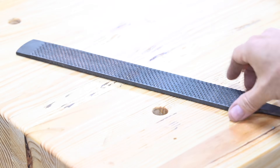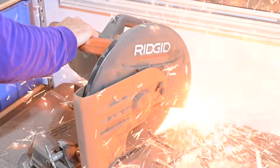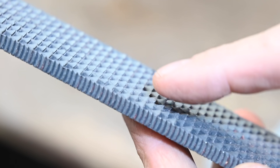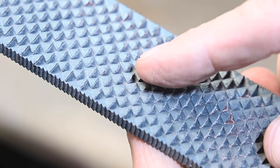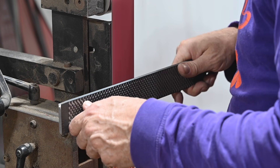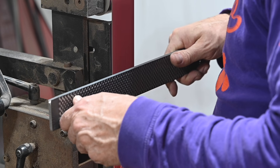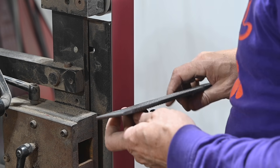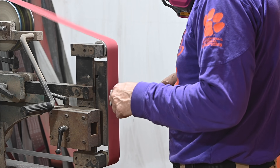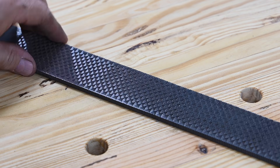So now we've got a nice soft piece of steel. First, I'll chop the tang off, then I'll grind down these burrs. You have to grind them down to some degree if you want the knife to actually cut, but you can choose how deep you want to grind them. The more you grind, the smoother the knife, but at a certain point you start reducing the cool pattern a little. So it's a judgment call as to how far down you want to take them.